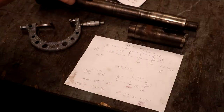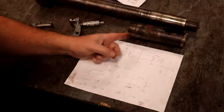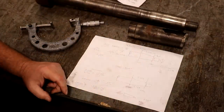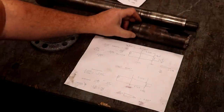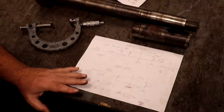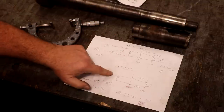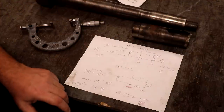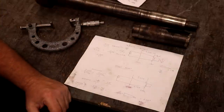This is the actual shaft we pulled out of the top — this is the taper piece. The taper was from here to here, and we had to cut the shaft off and bore it out. So I took the small shaft and the large shaft, did some measurements, and calculated what the taper was on both of these shafts. My original assumption was that the taper would be the same on the top and bottom shaft, but to make things more complicated, the actual tapers are different as well.